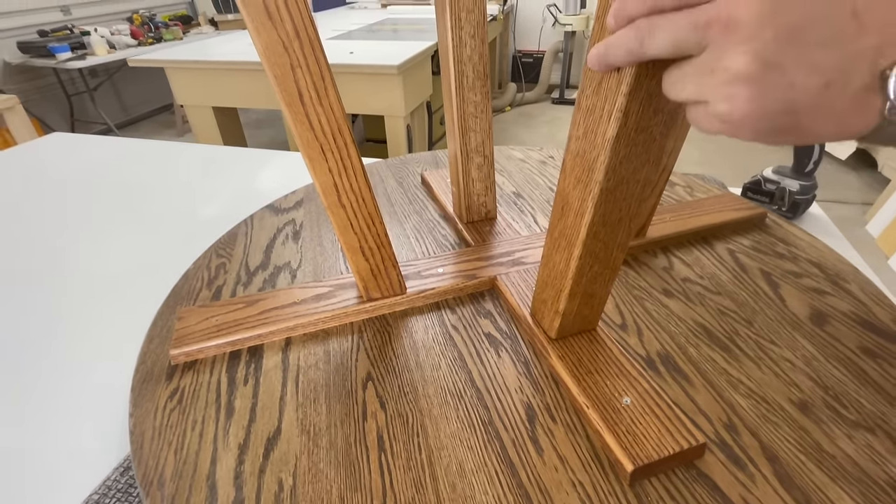How beautiful! We're all done with our table. We did a great job doing a dupe on the round oak table we saw online. We did five-quarter thick for the top and four-quarter base, gluing pieces together to give it a nice chunky cross base. We got it all put together, sanded out, and did a ceruse top to give it a nice new-looking weathered barn finish. The one we saw online was over $2,500. We built this table start to finish, including the finish, for $250.